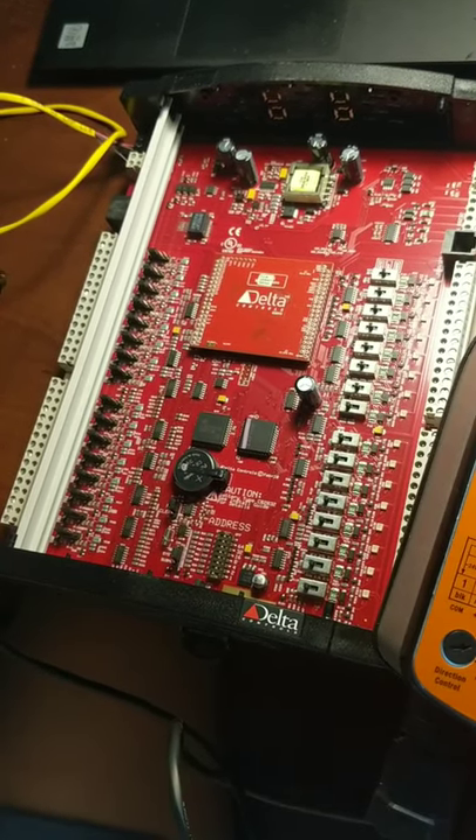There we go — controller has power. Output number one has hand, off, and auto modes. Auto is controller-programmable, but for demonstration purposes I'll just use hand and off, which correspond to 10 volt and 0 volt. So it will either go all the way or stay at the failsafe position. Since this unit has SR in the name, it can be modulated. Now I'm turning on the power.